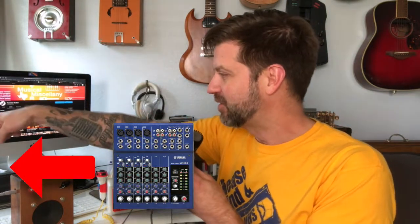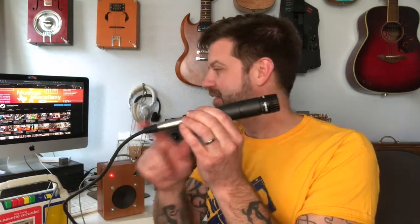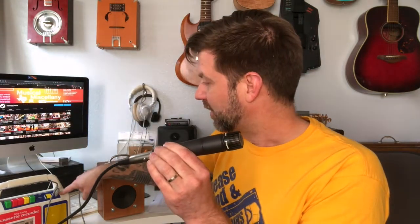Okay, this might be a good opportunity. Let's try, I mean, why not? You only live once. Let's try plugging the mic into, I've got a mixer over here. It's just out of the frame, but let's try plugging the mic into the mixer and then plugging the line out from the mixer into the line in and see what happens. I took the SM57. It goes into the mixer and then I've got the gain boosted all the way on this signal. And then the mixer output is coming back out and going into the little tape player here.